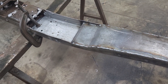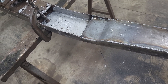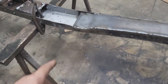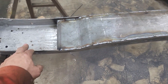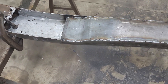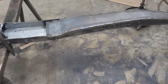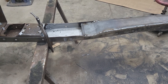I got probably about a sixteenth of an inch just looking down, and for me that's plenty. I wanted to make sure that as I'm heating it up, yeah it's gonna burn down a little bit and I am going to get weld beads that melt into it, but then I'll come back and spray it with some sort of chassis interior paint — those bomb cans that you pull through with a tube and spray everywhere.